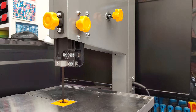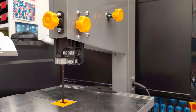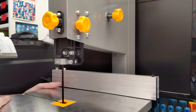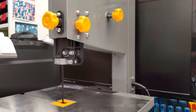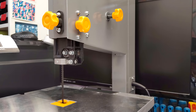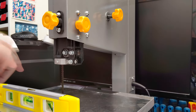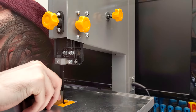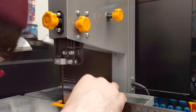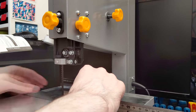After fitting the table, the next step was squaring the blade to the table. You raise the blade guard as high as it'll go and put a square between the blade and table. The issue was I don't have a small enough square, so I spent five or ten minutes trying other pieces of metal I had lying around. Eventually I used my combination square to find the edge of a ruler that was definitely square and tried to use that. It didn't work very well — I'll need to get a smaller square to do it properly, but for now it was good enough.